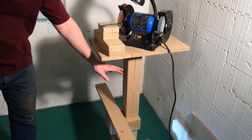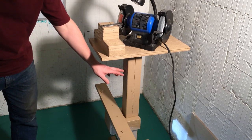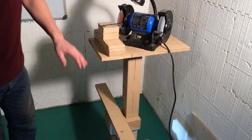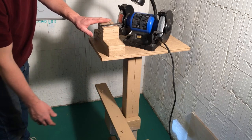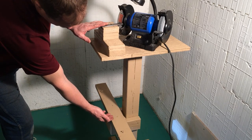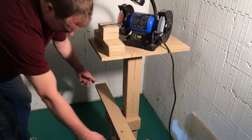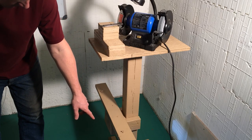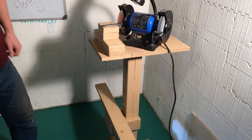It's just a piece of 4x4 and it's cut to whatever height you want. Right now I have this one at 36 inches high. When you mount the head onto the 4x4, you need to put a support bracket right here for the blade. The distance from here to here is about 24 inches, and this piece here is 30 inches long. For support for the base, you can put on a sheet of plywood and screw it. But I just have foot legs attached to the 4x4 to give it stability.